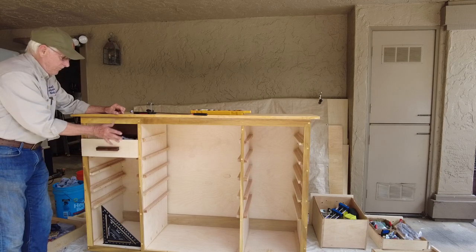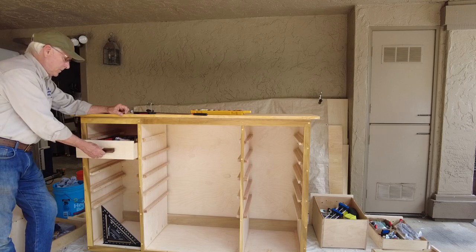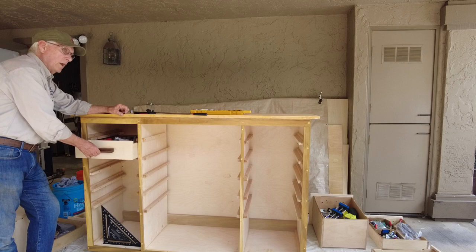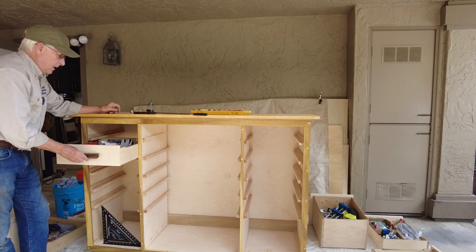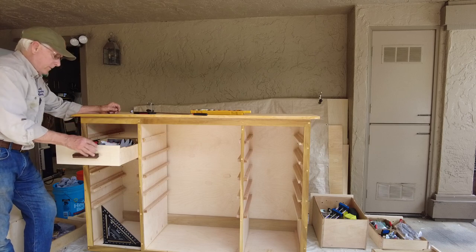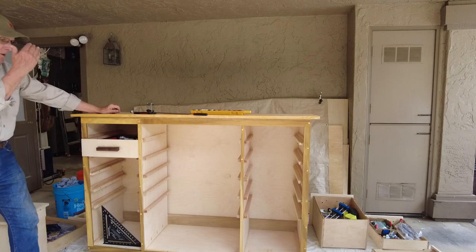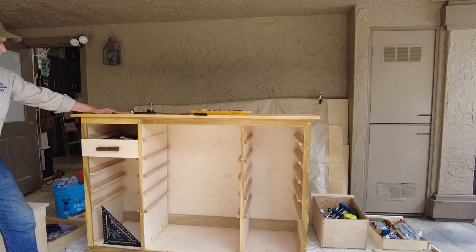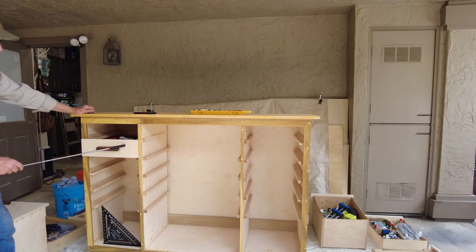I tried to do a sixteenth of an inch on each side but I wasn't precise enough and got a little more than that. The drawer goes in and sits up nicely against the face frame, so you'd think that would be fine. But when you're trying to align all the drawer fronts, the fact that the drawers move back and forth makes it very difficult to get proper alignment. I wish I had built my drawers tighter — just making the front and back a little wider — so they wouldn't move around as much. It is a shop cabinet, so that's not the end of the world. That's why you do shop furniture first.